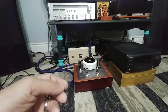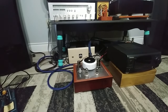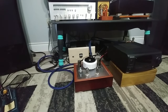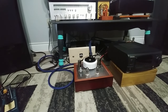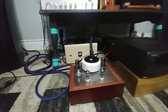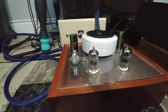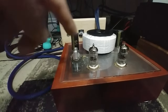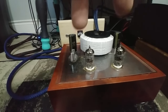I guess it's a two-plate step-up. I might try changing the value of the two caps - it probably doesn't like that. Or it could be the tubes themselves. These tubes have had a long service life and they were originally in a Philips micro system or mini system, and there were no vents.